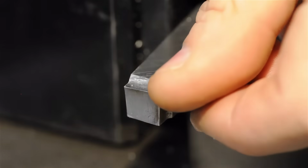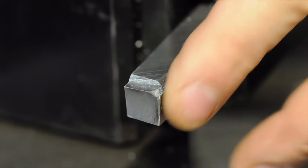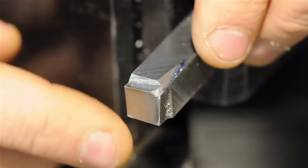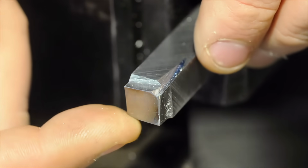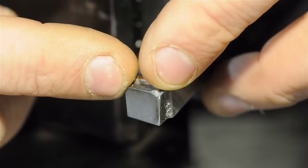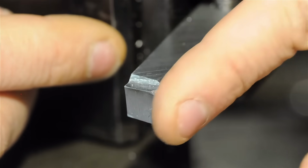In addition, we've left off the side edge angle. There's a sort of a lead angle that's usually built into these tools. Would have probably helped in this case, to be honest. But again, it didn't really come up in the approach that I took. If I'm not mistaken, for this type of tool, there are sort of 7 key data points that fully define it. It's those 3 relief angles, the 2 top rake angles, that gets us to 5. The nose radius is 6, and sort of that lead angle is 7.